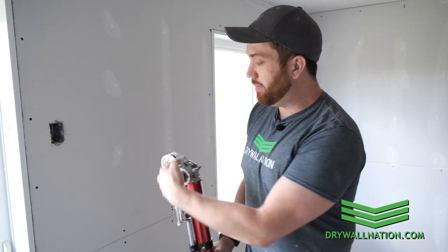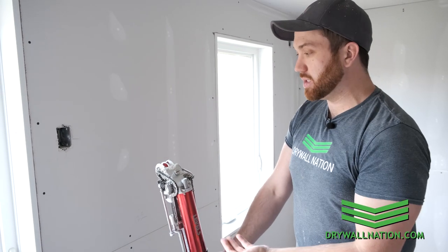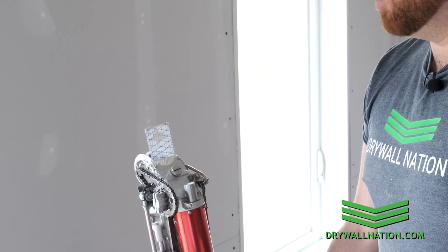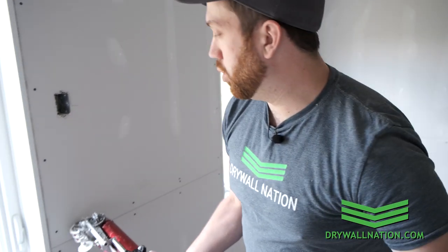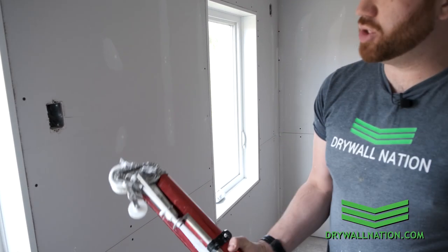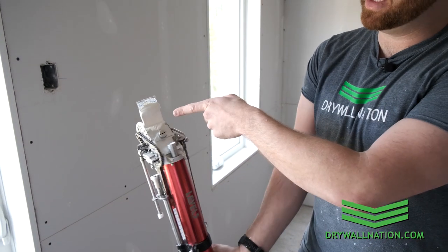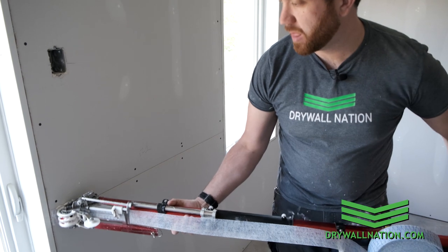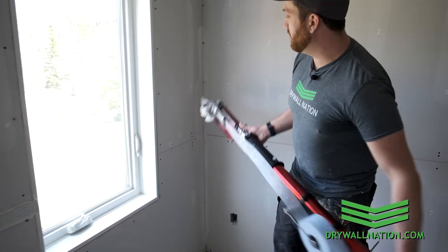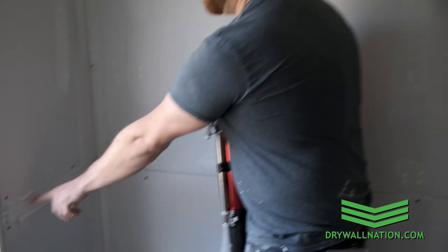When you're starting a new tape you want to get in the habit of rolling your drive wheels against the wall, and I'll show you why. If I haven't raised my cutter sleeve since my last cut, when I go to raise my cutting sleeve that tape is dry. So before you start a new seam, roll just the wheels on your tape — you're not pinching tape to the wheels yet because the tape hasn't been raised. Run your wheels on the tape, then advance or raise your cutter sleeve and you can see there is mud on that tape and you're ready to start taping. This is called loading or charging your head. Give it a little zip up the wall to load some mud onto the tape so there's no dry spot behind that tape.